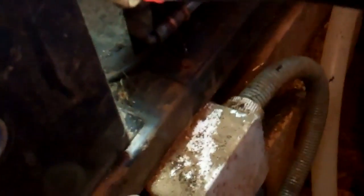There's a bellows on here. That's the LP side — low pressure. It's got a pressure setting and a differential. The high side, HP, is just a pressure setting with a fixed differential — usually about 80 psi or something.